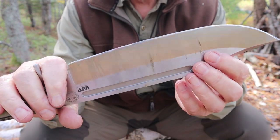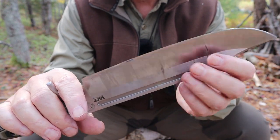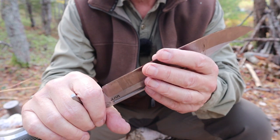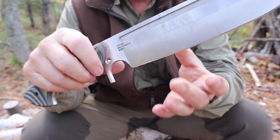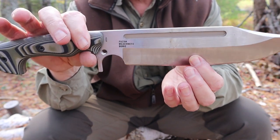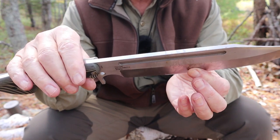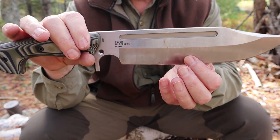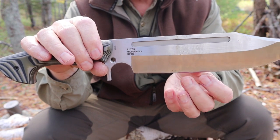Last thing to show you — and this is true of all of Vic's knives — is the secondary grind. It's a small secondary grind but it is convex and polished, which helps maintain the edge longer than a straight secondary grind, and it adds to the look of the knife. That's part of Vic's fussiness in his designs — he wants them to look really good and puts attention into detail that very few manufacturers outside of custom makers actually do. Vic's company in Taiwan is mid-tech semi-custom: modern machining cuts the blades and does the heat treating, but after that everything is done by hand, by family members for the most part.